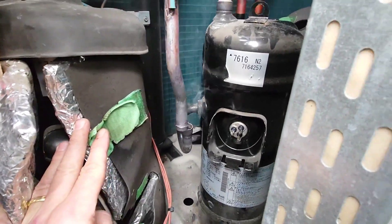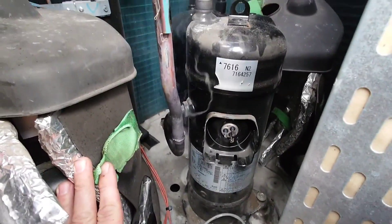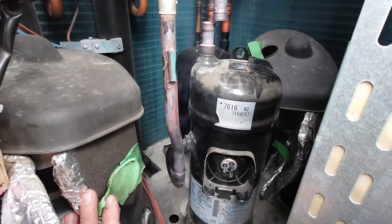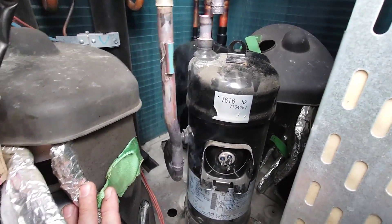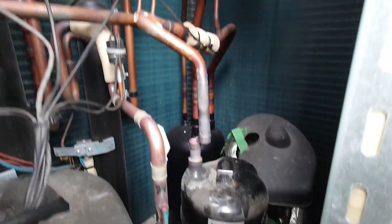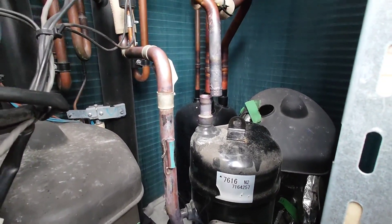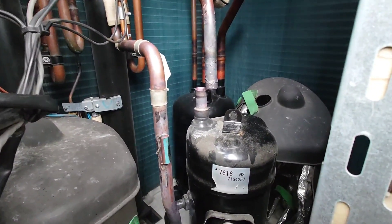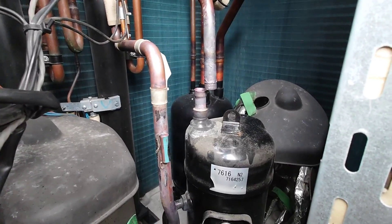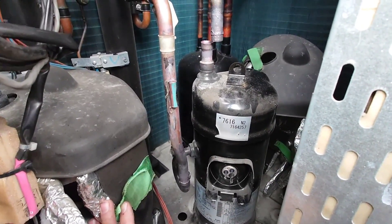We've got the top and bottom suction and discharge off the compressor, and we've loosened the bolts off so we know they're going to come out okay. Bear in mind when doing a compressor change you do get a bit of boil-off and maybe a bit of oil splatter, but it's not a big deal — on this one it was actually okay. This is going to be tough to get out because it's attached to the ref net, so it needs two people. One pulling up and one on the braze — one of you unbrazing while the other gives it a proper yank to get it up. It does go eventually, and now we're going to do the reverse: get the compressor out and put the new one in.